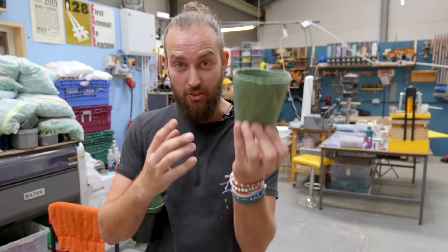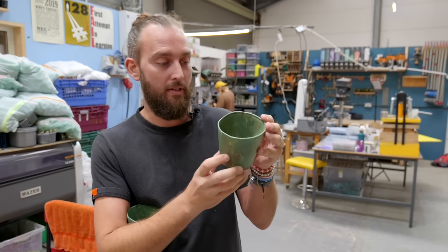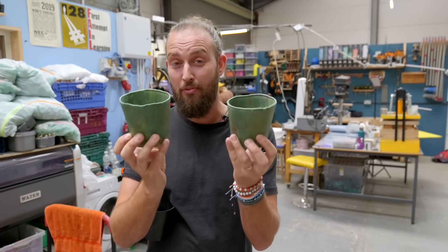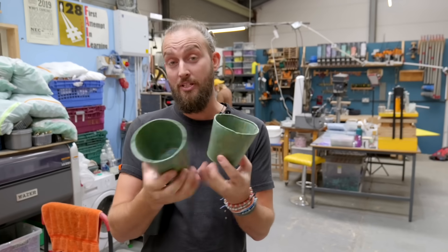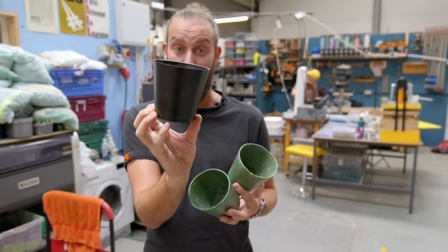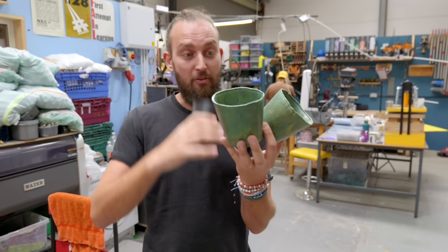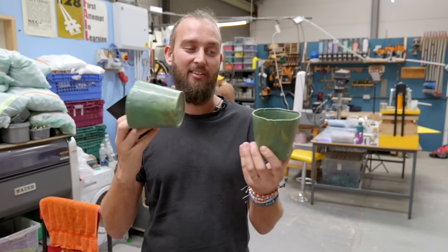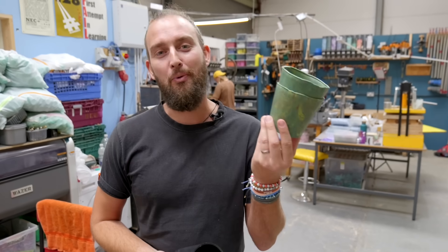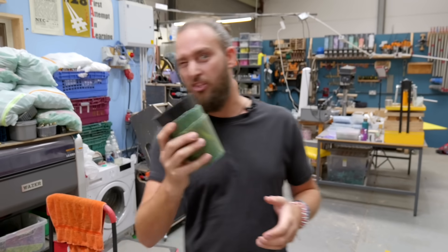So that is the UV damaged plastic. It's got this texture to it, like that powderiness the UV damaged plastic had before we shredded it up. We actually ran it twice — this one almost got there but didn't quite fill, and polypropylene should flow pretty well. This one with less UV damage feels fine. There's something happening with the flow rate because of the UV breakdown. It doesn't work well for injection. Also, these pots are really small and in order to use all that plastic we've made, you're going to have to make about 3,000 of these. So we're going to come up with a different plan to use more plastic and use all of it.